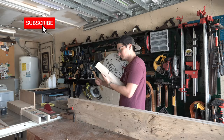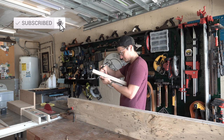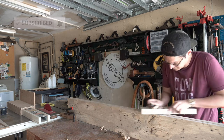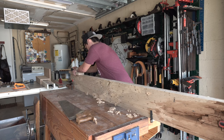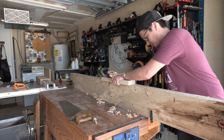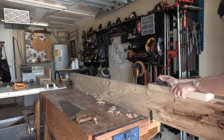Onto some actual woodworking commentary, if you want to have better glue-ups, plane or joint your boards in a folded book match, so to speak. By planing the two boards at once, they become complementary, so when folded back out again, each edge is congruent with the other, making for a seamless joint.